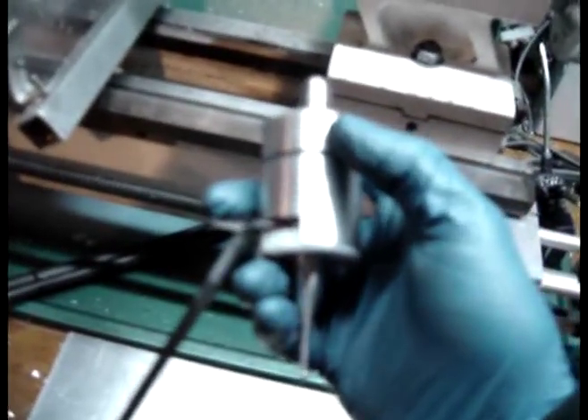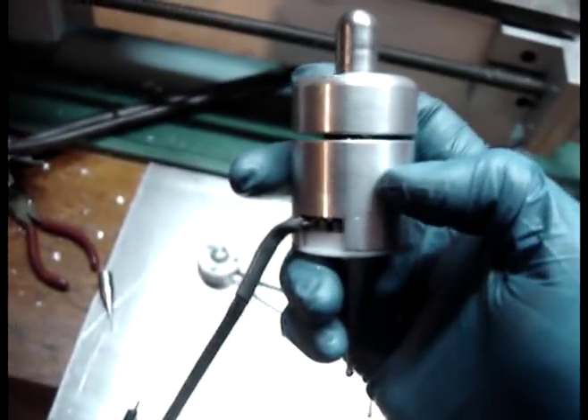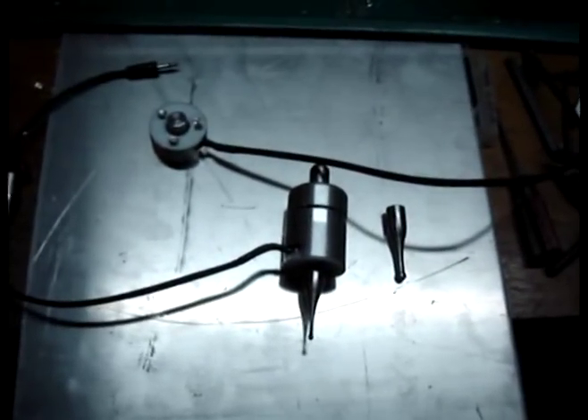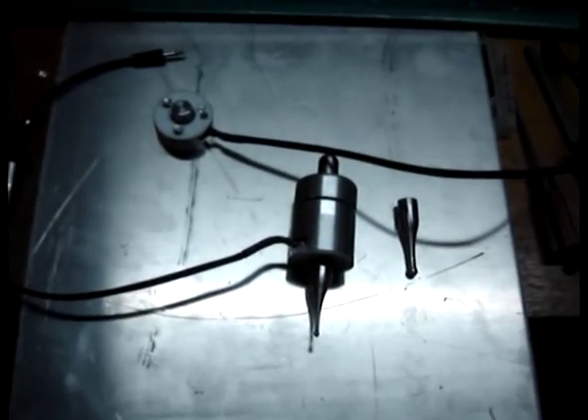You can digitize anything. The biggest downfall I've noticed so far is the wiring — how it's just soldered into the pins. Because every time I pick it up and move it and plug it in, these wires get stressed right here and I know eventually they're going to break off. Putting an actual two or three prong plug into the side of the case would make it a lot more useful. Or, as I really plan to do, I'm going to make a wireless one using simple RF radio waves, which I think will be a fun project.